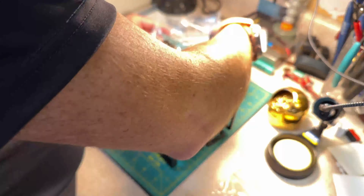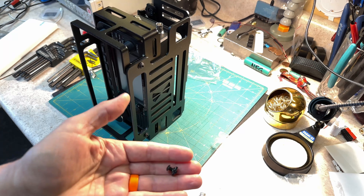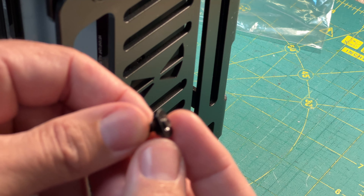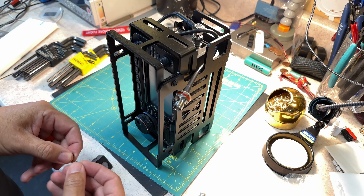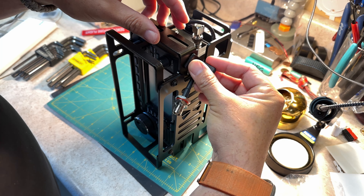Hindsight, you're a beautiful thing. This is what I meant by the way it's assembled — let me get you a better look. These bolts are T-slots. On something like this you get a T-slot: you slide it through, turn it 90 degrees, lock it in, and bolt in whatever you want. In this case, we're going to bolt in the holder for this extender, so the strain of the connection is on the extender and not on the radio — which I haven't had until now. Give it a couple of twists to keep it there, eyeball it.